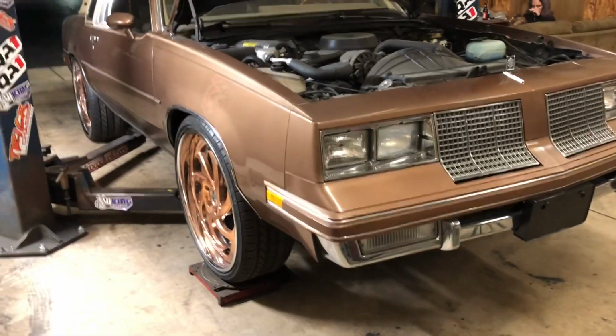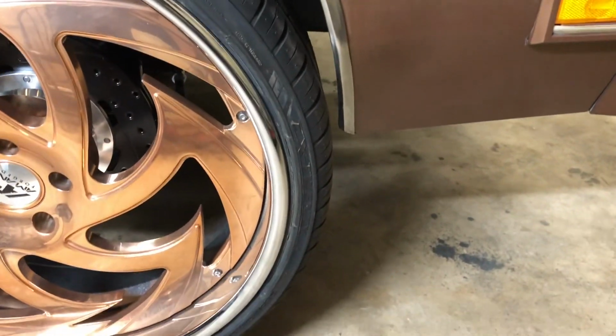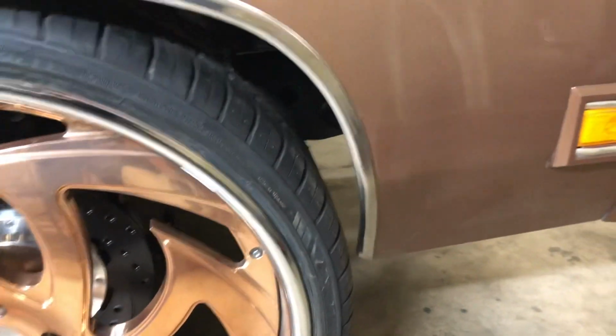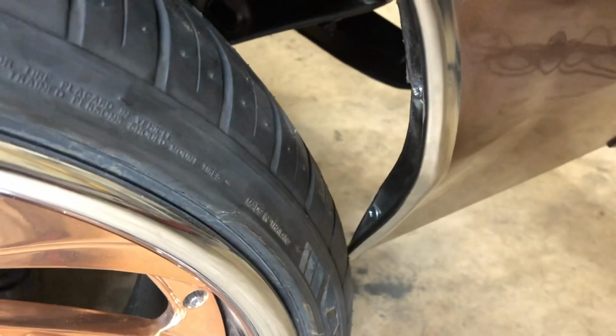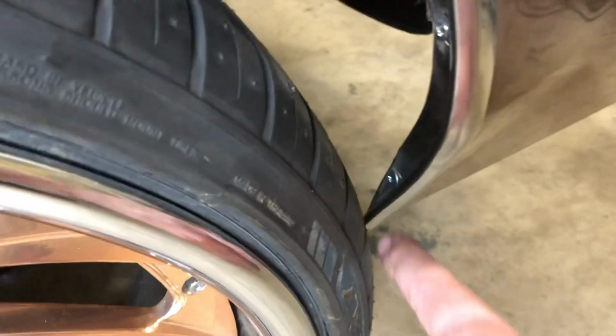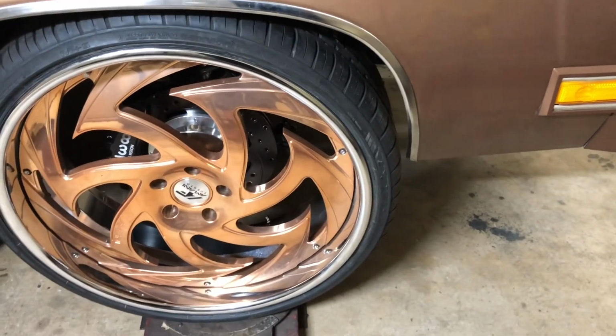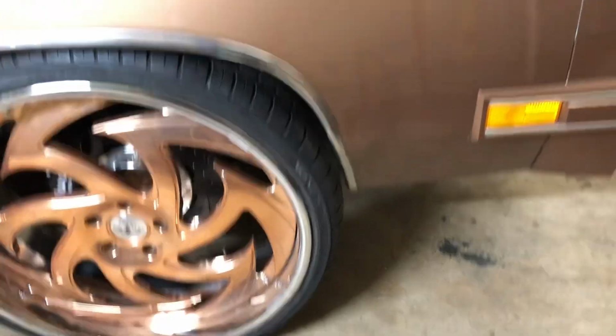But custom alignment, that's what I do. You can see that side's got clearance too. Did the same thing with that chrome. Boom, as you can see, there's a screw in there. I put a self-tap back in there because it's not in the stock spot. I'm talking about this screw right here. But I trimmed the fender, flexed it forward, put the chrome on, boom, both sides are moved the exact same.